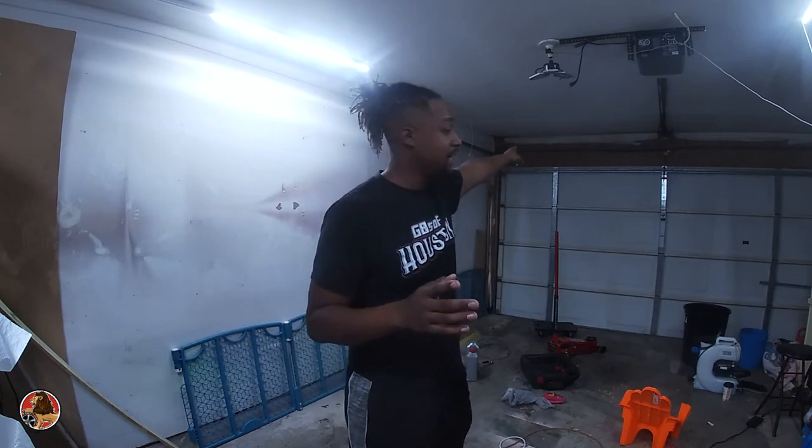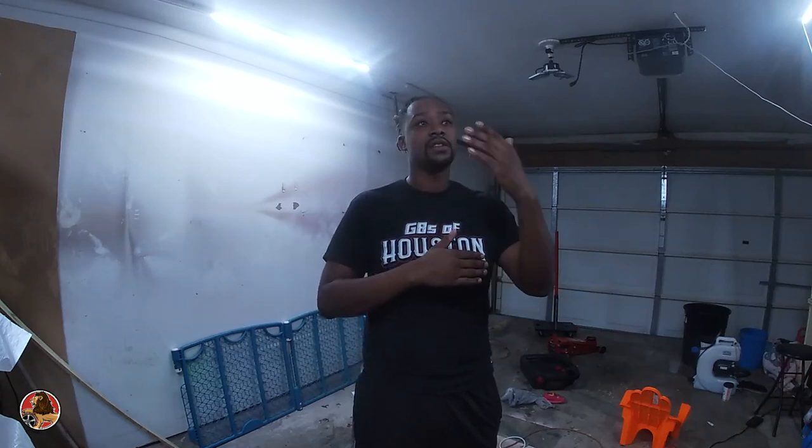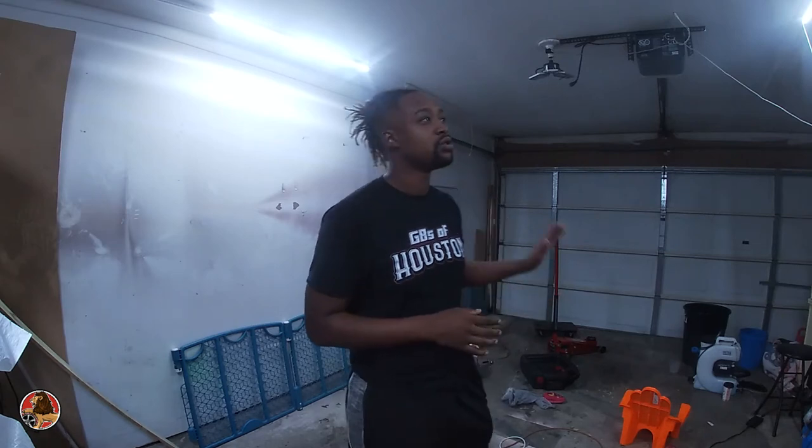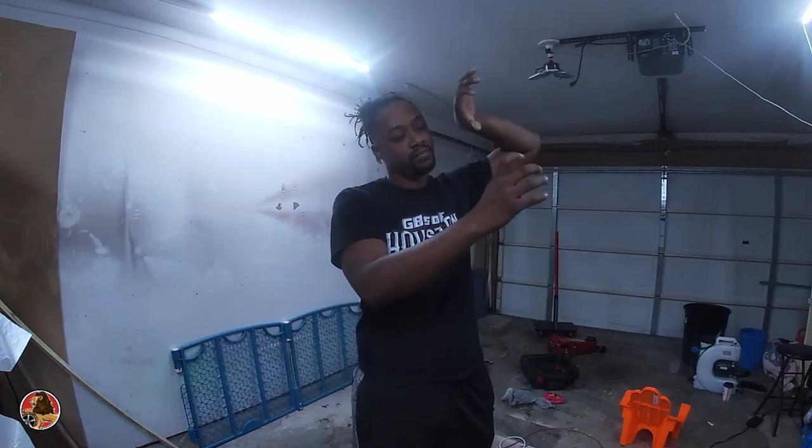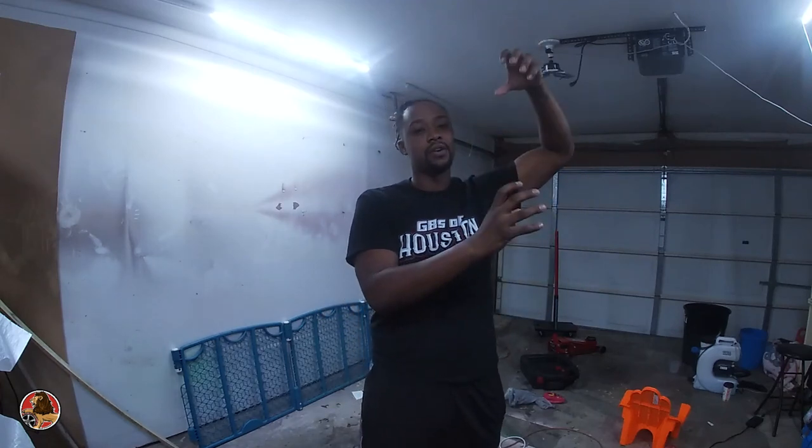The one inside of the van, that is a 4,000 watt, and I think it's a 3,500 running watt. So anything over 3,435, it's gonna trip it. I gotta go and press the reset button. Sometimes I gotta turn it off and turn it back on. It's only happened to me twice. Most of the time, if it does trip, it trips the extension cord that I have on there. I have a long extension cord, it trips that first. Sometimes, like I said, twice, it tripped the actual generator.